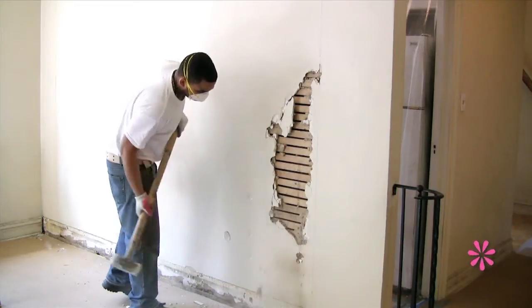As I told you in a previous episode, and as you saw when we demolished the kitchen wall, this is not drywall. This is plaster and lath, old school. You can't just drill a hole and then fish for the cable behind it. What you have to do is channel in the wall and then bury the cable in new plaster.